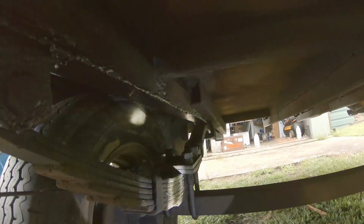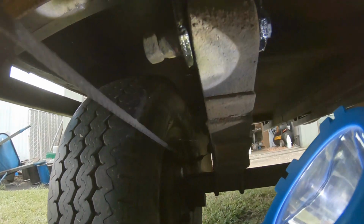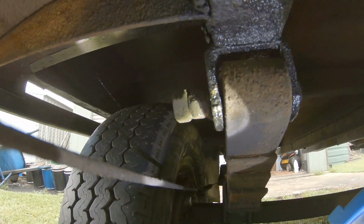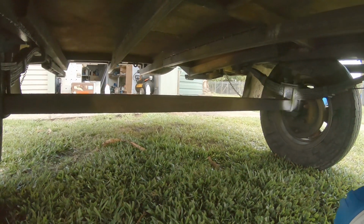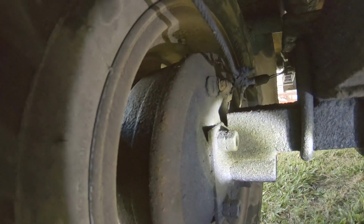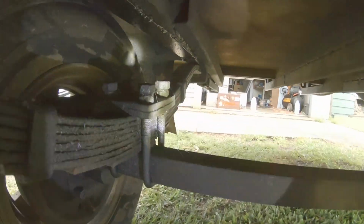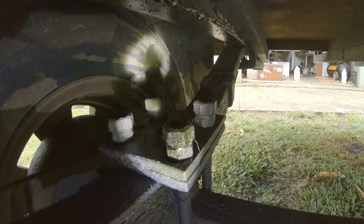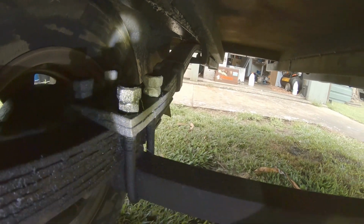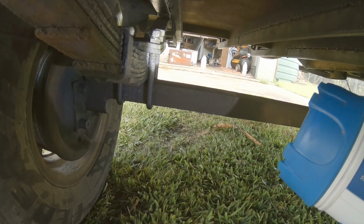So yeah, that plate there. We've got to take these forks, because I lock nut them, see? I'm not a great fan of Nylocs. Up here too, I even lock nut these. Those things there, lock nut them. Any bolts that are on this van, look at that, see, even here, on these plates here, double lock nut them. Nylocs just come loose anywhere on corrugated roads, or decent corrugated roads. See, there's double lock nutted. So you can see then, you can have a Nyloc nut on the bottom, and then you just get the same thread and put another one on top.